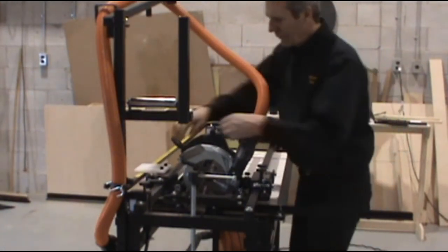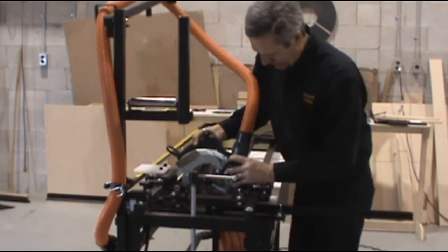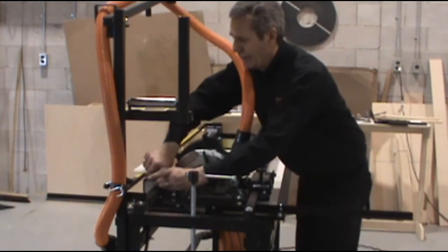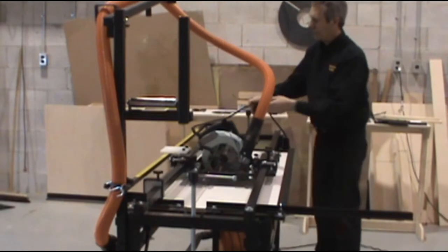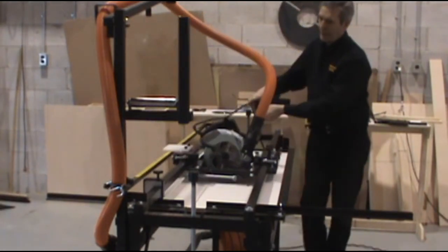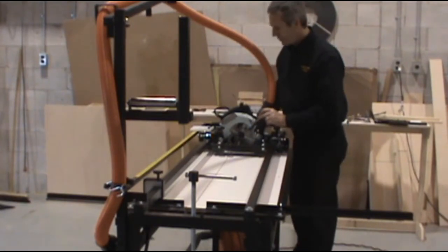We'll go to the other side and set it at two inches, then position the rotor stop there. So now the saw is going to stop two inches short on the back end and two inches short on the way up here — stopped by the rotor stop. Very carefully drop the saw no more than one sixteenth of an inch.